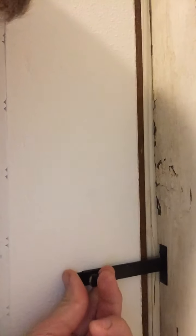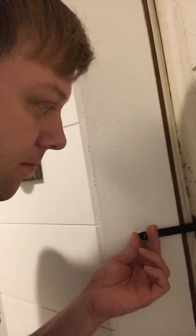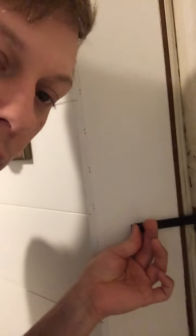Looks like I'm engaging the door about a half inch, but I could have done even more — maybe three quarters or even an inch with that bolt engaged. The more your bolt engages the door, the better. You don't want to mill that pocket in your door to the point that it comes out the back side, but this seems to work pretty well.